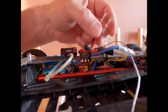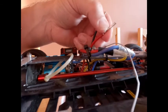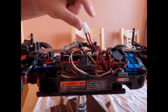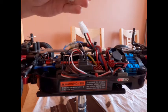I've crimped them down and they fit really well — not loose, no loose connections. There are some little tabs on the end here which splay out once I plug this on, so there's kind of no going back. I've got to make sure they go on the correct polarity. You can see by this one — you've got the red and the black wire with the clip — so I'll just put it on the same way. That's those on, nice and secure — a nice clean connection. That's the old one.